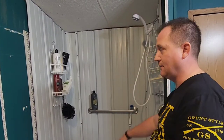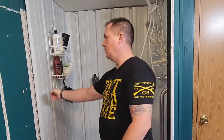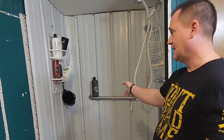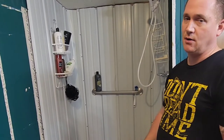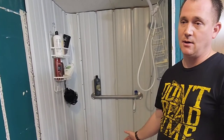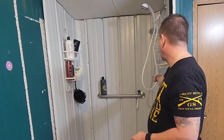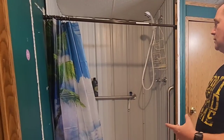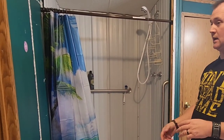If you're looking for a budget-friendly shower, pop your old shower out, get the right size shower pan, do your measurements, and you can use any sheet metal or galvanized steel that's not going to rust. This stuff has a 40-year warranty. You don't have to spend $1,500, $2,000, or $3,000 — we got less than $300 into this including the rails and the faucet.